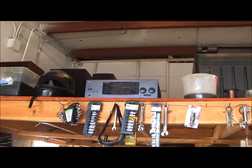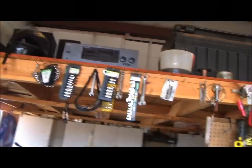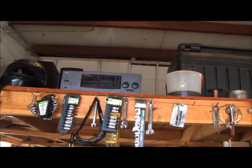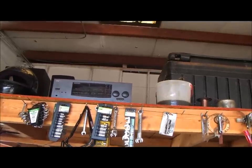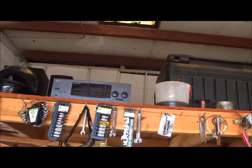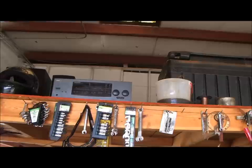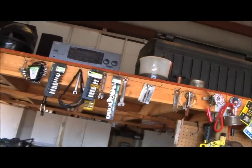It's simple: don't hook up your speakers in parallel if it drops your load too low. Say two 4-ohm speakers in parallel — you've just made a 2-ohm speaker. That's fine if your amp can handle a 2-ohm load, but if you have a choice, always wire them in series. It's okay to go up to 12 or 16 ohms. It is not okay to go down in ohms, because that's what heats and cooks your finals.